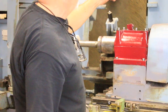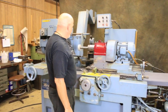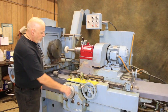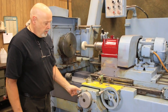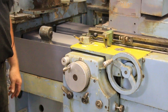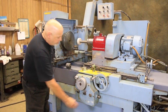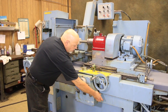We're going to go ahead and turn this on now. You want to make sure your table is off and you've got your stops set and they're set tight. Right now I could feed in with this by hand — there's even a very fine knob up here to use — or I can engage the feed and it'll feed by itself. As I open this up it'll feed faster, or it can feed slower, and this here will adjust the amount that it feeds.